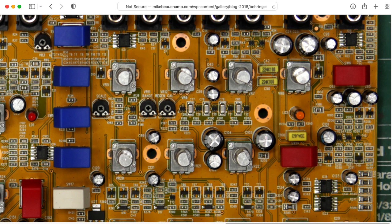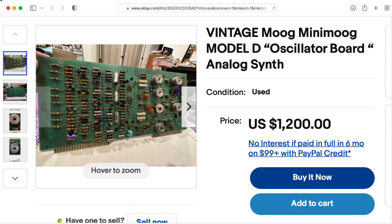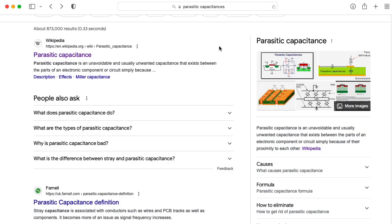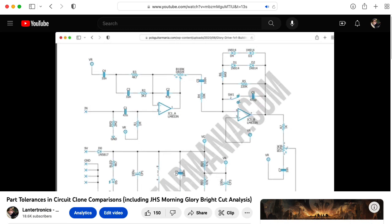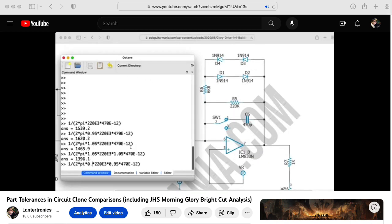But knowing what I know about the Mini Moog circuit, just looking it over, it looks like all the parts are there. They're surface mount and not through-hole, but that doesn't matter. And yes, there's a different layout, and yes, these things will lead to different parasitic capacitances — but those differences are going to be less than the various differences you'll get in inherent part tolerances anyway.